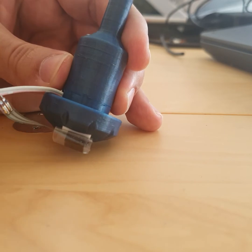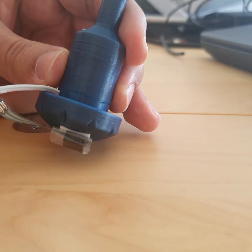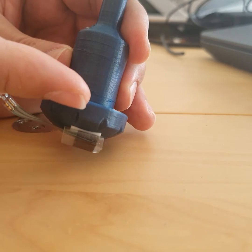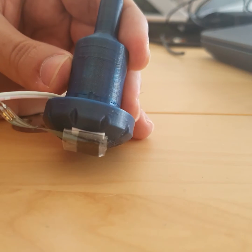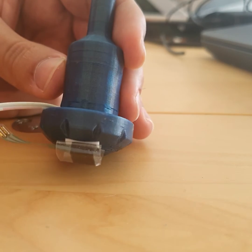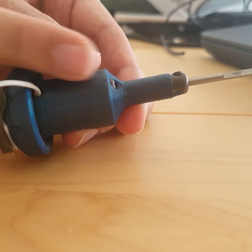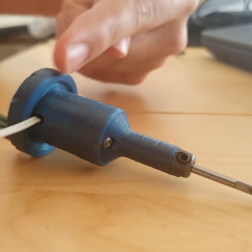The orientation I put before was parallel to the magnetic field of the solenoid, so every time the solenoid would activate it would create a magnetic field and give incorrect readings. What I plan to do now is flip the Hall effect sensor to see if I get a better reading, since the magnetic field of the solenoid will be in this direction and the magnetic field for the Hall effect sensor would be in that direction — so they won't compete with each other.